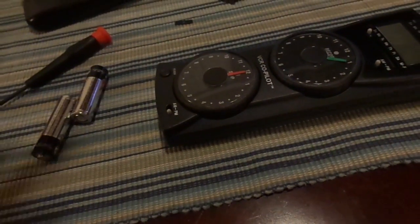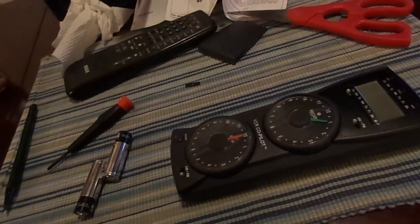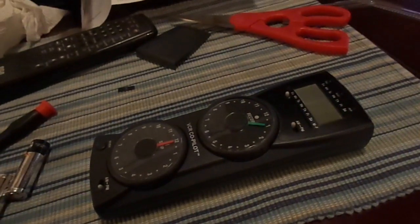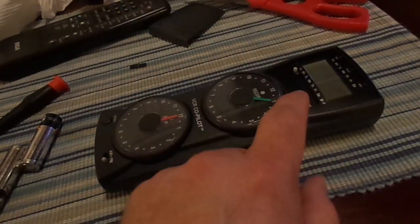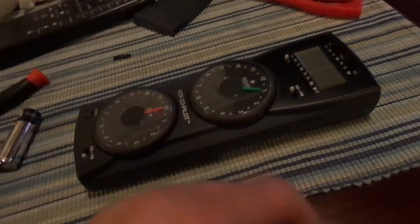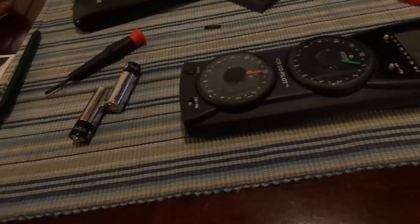And then I come back from the hospital and the device has turned the VCR on. Actually, all it really does is it presses the record button on the VCR by emulating the remote control using the remote control codes for that VCR. Okay? So all it does is that the VCR has to be turned on and set to the proper channel. It emulates the record button functionality and the stop functionality. So at 1 o'clock a.m., it essentially presses record. That's all it does. It couldn't be simpler. But it also could work, too. But, you know, details. Now, when it's done at 12 o'clock p.m., it just presses the stop button. That's what it does.